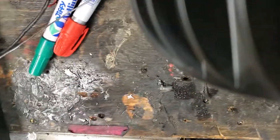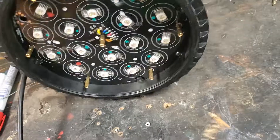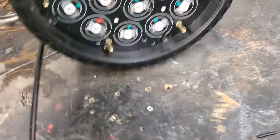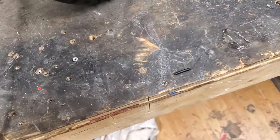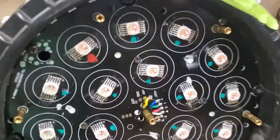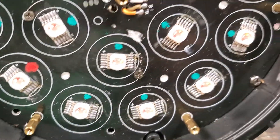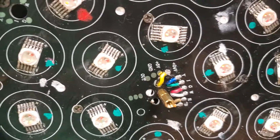If you buy really high-end LEDs they're probably in parallel, which means if one lamp burns out they just keep running. If you buy these cheap ones they're in series and you lose the whole color. So this one here has no red working. We have red — see, it's just showing a little bit through each one, all these diodes here, you can barely see red.